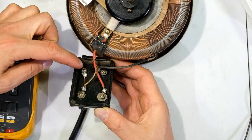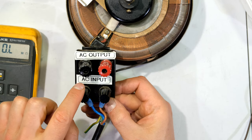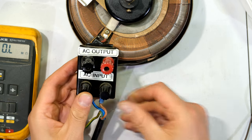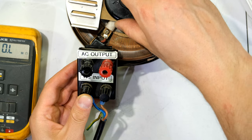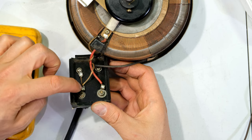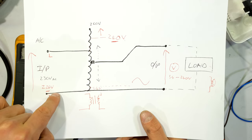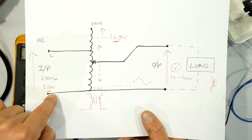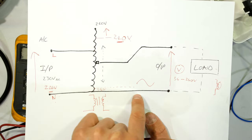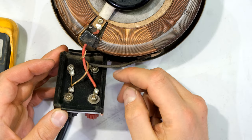In your country it might be different — it might even be red and black. I'm going to flip this over to show what's happening on the inside. You can see there's a link between that terminal and that terminal. On the bottom it was AC input, on the top it was AC output — the output after I vary the voltage. Look at that: that terminal and that terminal are the same wire. Going back to my diagram: the neutral from the input to the output is the same wire.